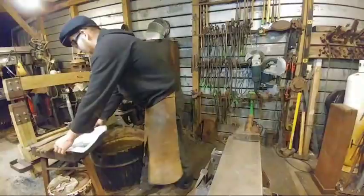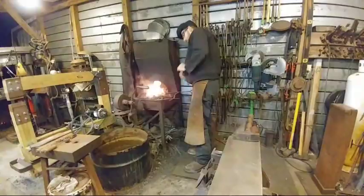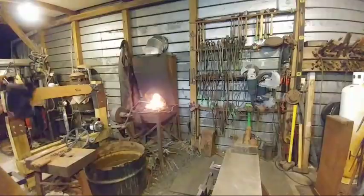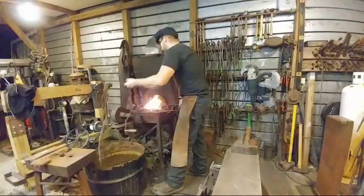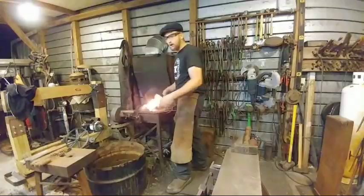Let me move this over. And FFC Rick says, how to know what size hand crank blower is needed. Let's see here. This is a Champion 400, so I can recommend it. I think most of them come in Champion 400s and Champion 600. Well, yeah. Is that right? Yeah, Champion 400. I think they make a Champion 600 out there. Might be wrong on that. But unless they have a CFM rating, or cubic feet a minute of airflow that they can push, it's really hard to determine, especially on old blowers. It was just however well built they were.